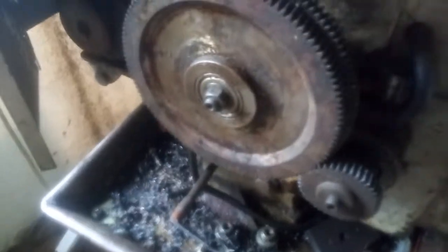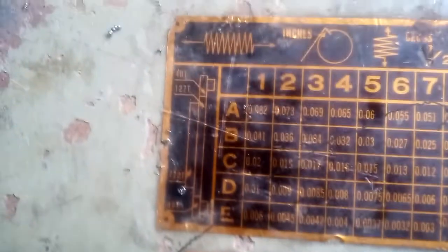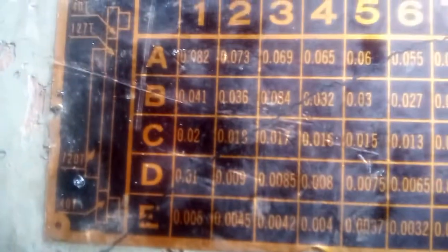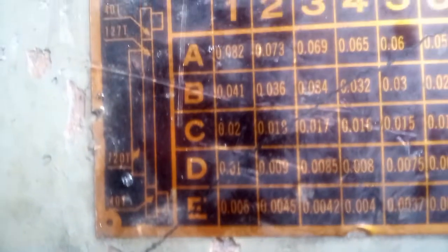And then by arranging the gear train here and the gears here, you get an exact millimeter metric thread. It converts the lead screw from imperial 8 teeth per inch to nearly all metric threads, like 2 millimeter, 1 millimeter, 1.25, and all of that. You probably won't read this, but you see the inch and the millimeter, and then it gives you what wheels to use, and how to arrange your intermediary, and which one to use. How to use the levers. There are 2 levers, and you can see the various metric threads you can get. And I have cut all the handy ones on it.